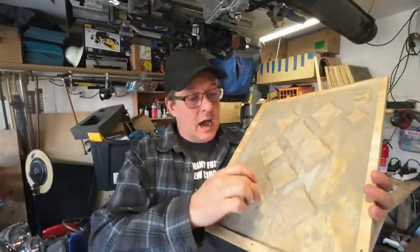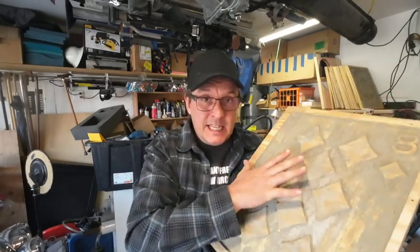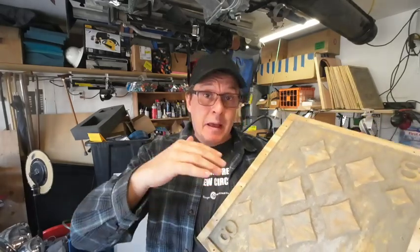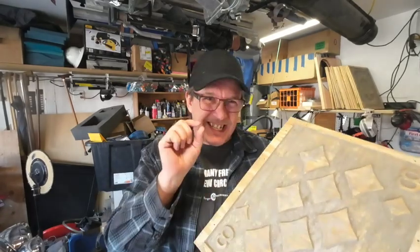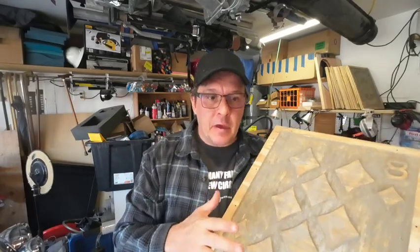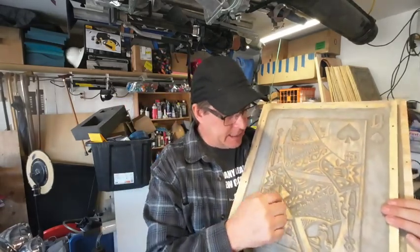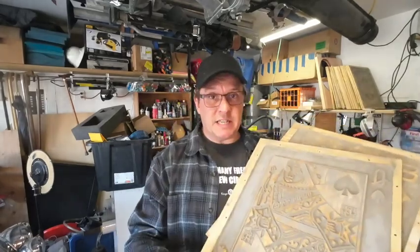So the cuts on the molds, I wanted everything to be able to be seen and be a good height difference and cut in, but I didn't want it so deep that it would become a trip hazard, because they are supposed to be walked on. So I went just a little under a 1/4 inch max depth on some of the more intricate ones. Some of the thinner lines didn't cut as deep. And the big open cuts, just enough to where I think they'll be safe.